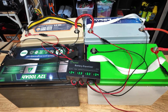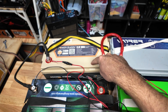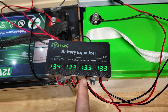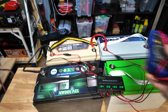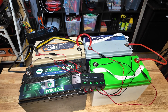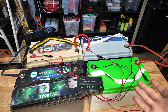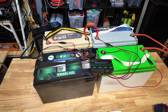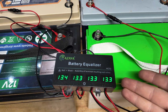It's been a few days with the balancer equalizer on these batteries. If you guys remember, when we started, the voltage on this battery was lower than the rest. As you can see, they're almost all perfectly balanced, but I don't know how accurate the voltage display is — it only has one extra digit after the decimal. We're going to take our multimeter and verify all the voltages on all the batteries and see exactly how close they are. Do keep in mind that because these batteries are just resting, the voltage may equalize pretty easily, but once you put a load on them, that's when they're going to kind of separate. Also, when you actually fully charge these, the one that hits full charge first is going to have the highest voltage — and that would actually be the best time to equalize. Doing it this way at least shows that this unit is actually doing something and it's not just a box with rocks in it.